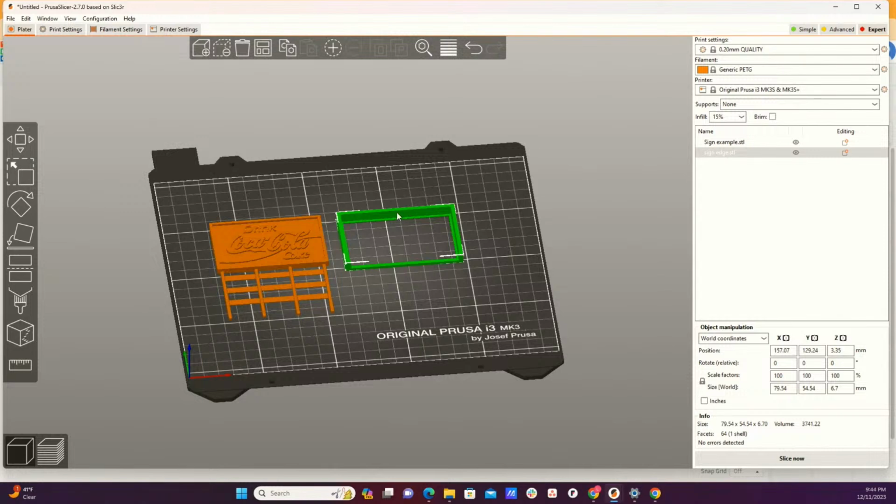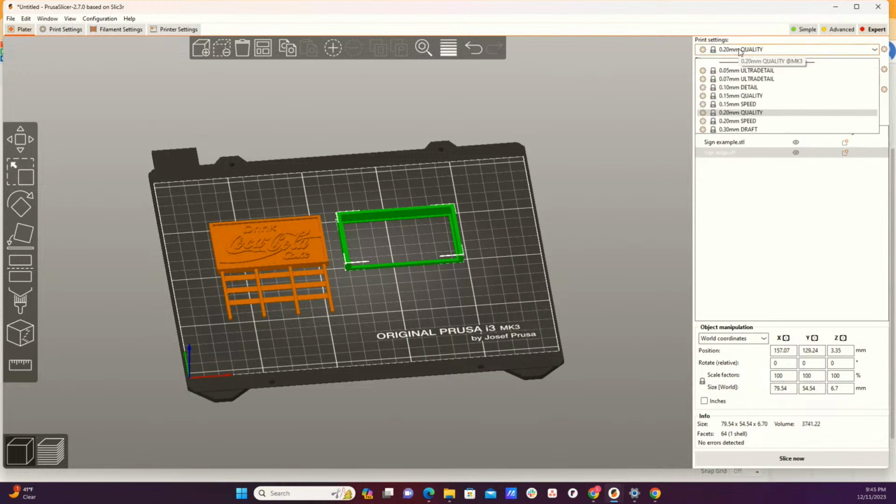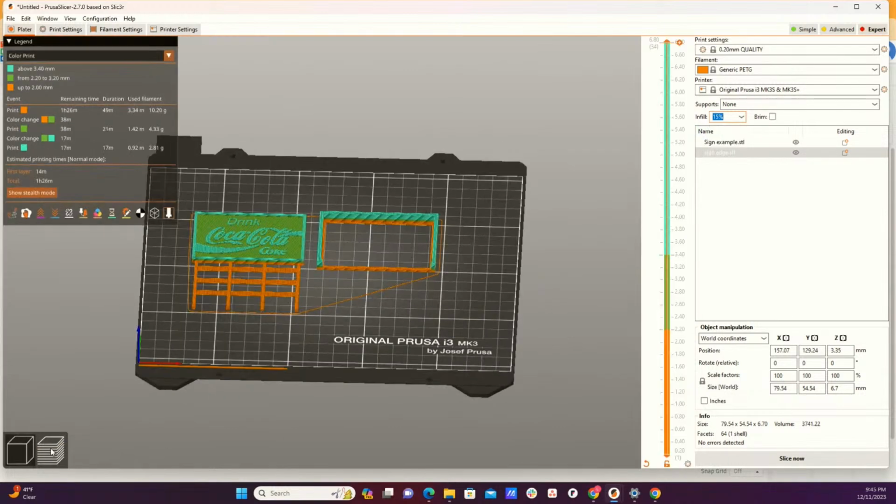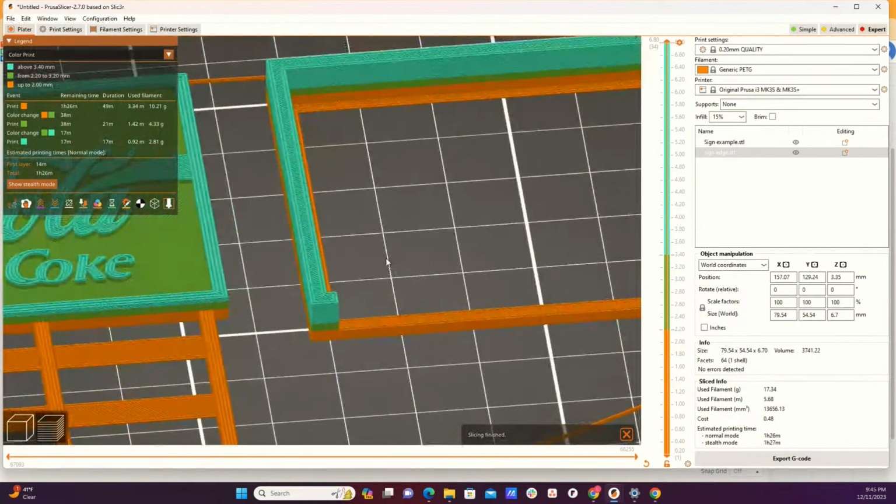But yeah, so the workflow: you got your printer, you take it home, you find a model or you make a model, you pull it in, and then the last couple things that you need to think about are the type of plastic and the quality. And beyond that is, do I need supports, or like they were talking about skirts and brims. These are just different things to help make sure that your model comes out as expected. Infill, right? A secret: a lot of people talk about adding more infill. Unless you get to 90 to 100%, it doesn't really help the strength of the part as much as if you added more perimeters. And perimeters being these walls here.